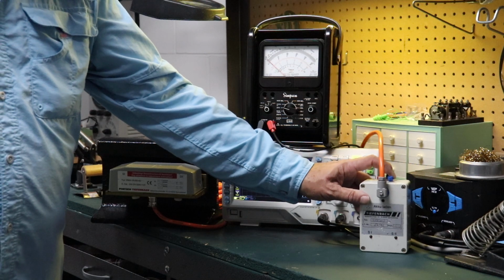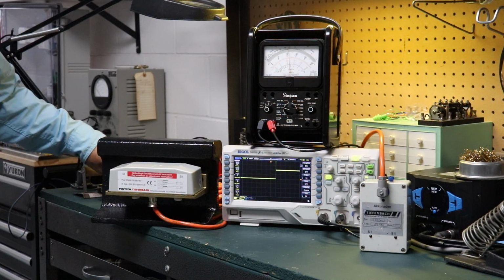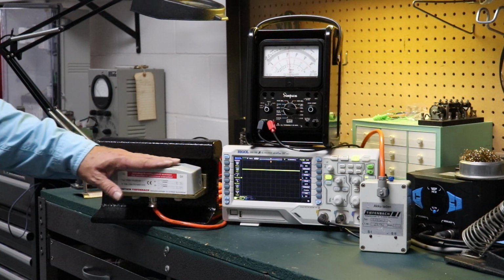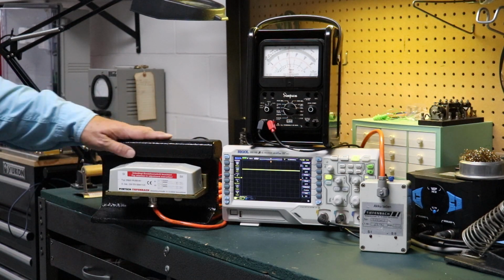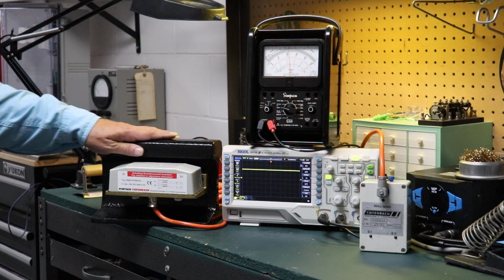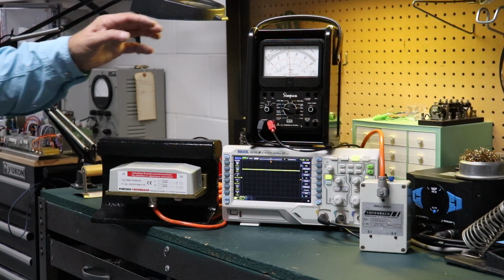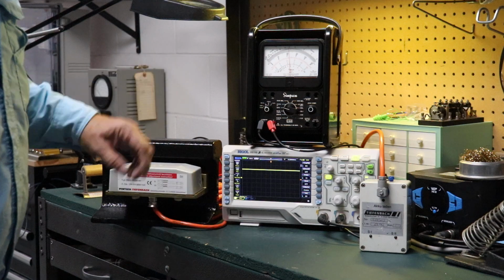So I'm going to turn on the R58 device, and you can see now that with just the sensor mounted on the rail, I'm generating that electromagnetic field. I'm applying 8 volts. It's coupling into the head of the rail where it sees mass and density and so forth, and this creates a damping effect. And so the voltage we're currently measuring across the pair looks to be in the range of about 4.5 volts.